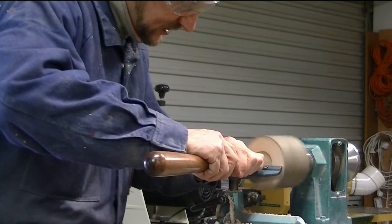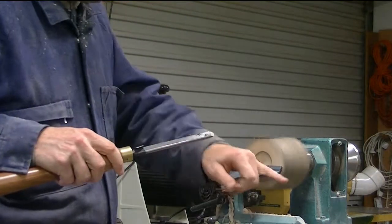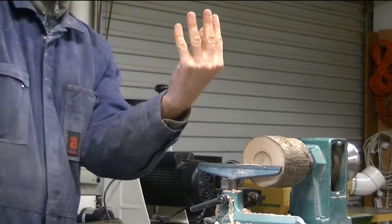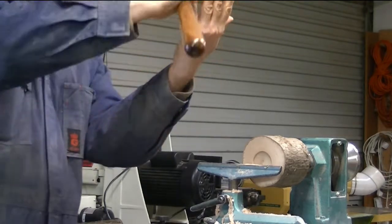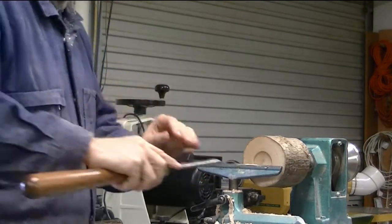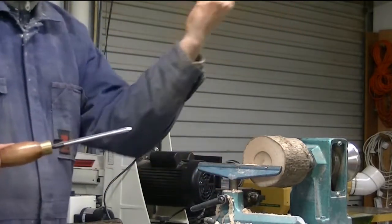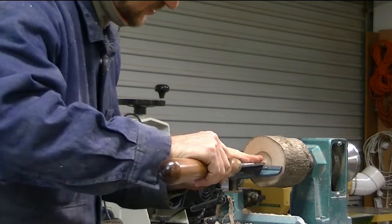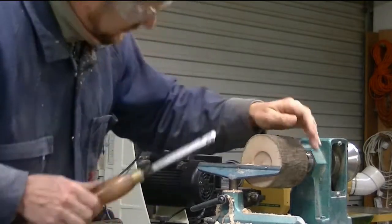and just try to press down evenly on the fibers. In end grain cutting, because the direction of the fibers are like that, if you're going to push them in, that's good. You don't want to try and pull them out like that. So pressing down is a good way to cut them. Pressing along is also good, but that tends to push them out. Pressing down into it gives you a pretty good finish. Just seems to be pretty good.